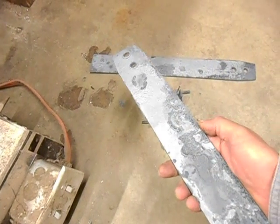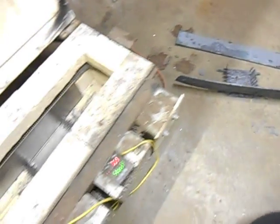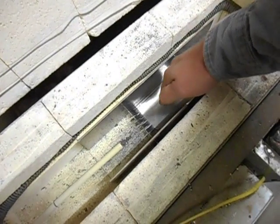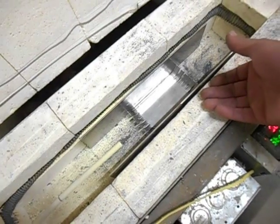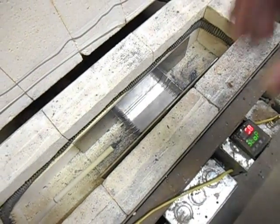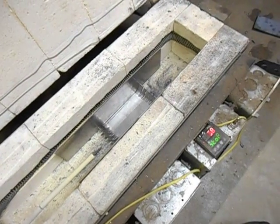These are baffles. I know a lot of guys that heat treat one blade at a time. You know, they will put one blade in the center of the kiln, sometimes at room temperature, bring the whole kiln up with the knife in it to whatever temperature, quench that one knife, and then they're done heat treating for another week or so.